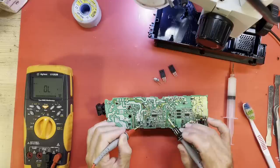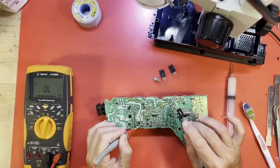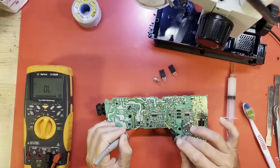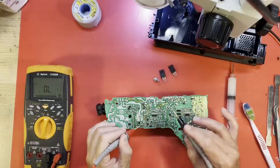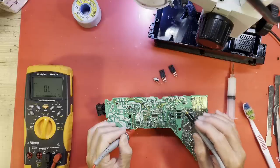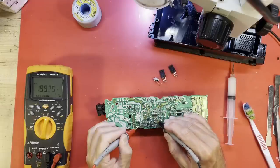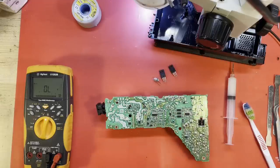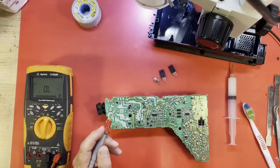I wonder what that connects to. Some of these outputs may be going to these MOSFETs, but there's usually some stuff in between anyway. There'll be a zener or a diode and resistor combination. But it could be because I'm missing those things. Let's see what 11 is specifically, if I can find some notes to that effect. All right, that is what they call the half bridge connection, which I think connects between these two MOSFETs. So that's probably normal since we have the MOSFETs out.